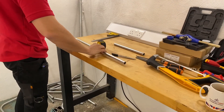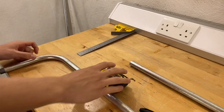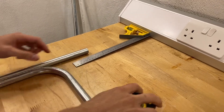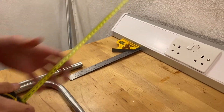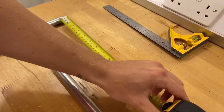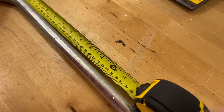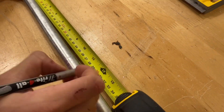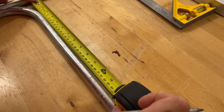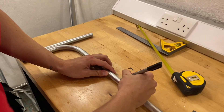So we're then going to measure — as you said — 300mm from the back of this bend to our next mark. We're going to use the scrap piece of conduit as a sort of datum line. So this is 300mm. I like that — using that scrap piece of conduit you get that 300mm mark. It's important you take your time, get in the right place — check twice.